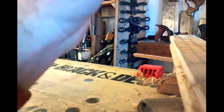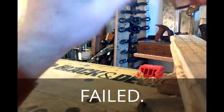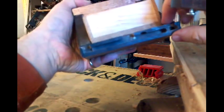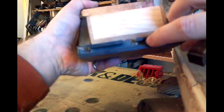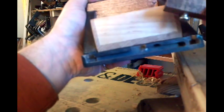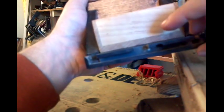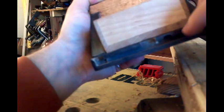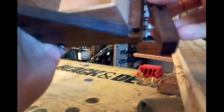I can reassemble it really quick and show you again how it slides together. Slides forward — and then you just slide this one piece in. One thing I forgot to mention: you can make areas of less resistance here. I tightened the screws on the front of this piece to create more friction there, so it doesn't slide past. I drilled a little wood out of the face and found that when I did that, the wood came slightly out of alignment with the key and didn't want to go further without extra effort — acting as a little stop. It hasn't come apart by itself in six years, so that works well.